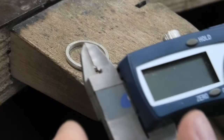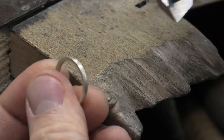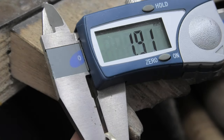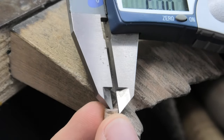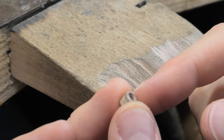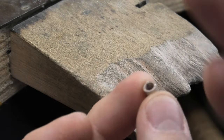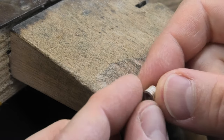Let's get on with it. My last shank was out of my junk box and was thinner than I would have chosen. This one's chunkier than I would have chosen, but I'm not changing it because I ain't got time. So if you're interested: I've got 1.6 deep by 1.9 wide, and then this is just over 5 — 5.2 deep — and the thickness is 1.1. That's quite good because it's thick and gives you space for cleaning up after without making it too thin. And if you're making something to be cast, consider that after casting it'll need more papering and polishing, so you lose a bit more metal again.